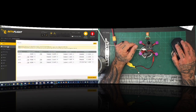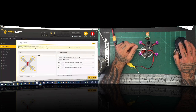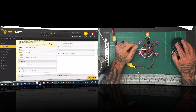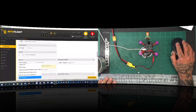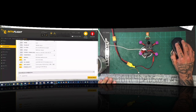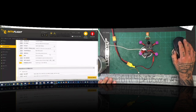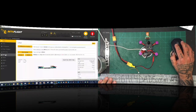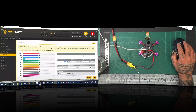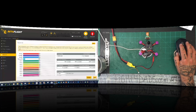If it hangs, just hit disconnect, make sure your ports took, go to your setup. Ports — okay, that took. Configuration — I'm going to stick back at multi-shot. We are going to turn barometer and magnetometer off, go to 4K. We're going to call this the CFPB-QI96. We are going to go to serial-based and use S-Bus. Air mode will not be on all the time. OSD will be on, anti-gravity will not. Let's click save. Then disconnect, reconnect, go to receiver and power this back on. Change this to 1005, just like we did before, and 2000. Click save.